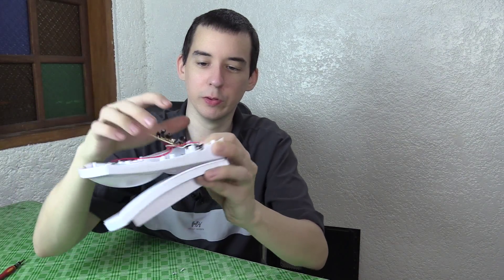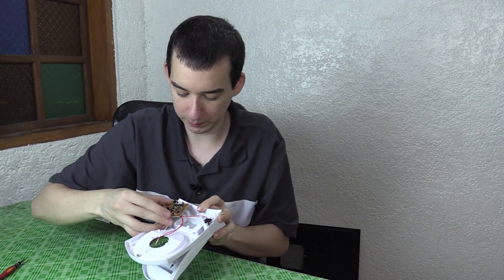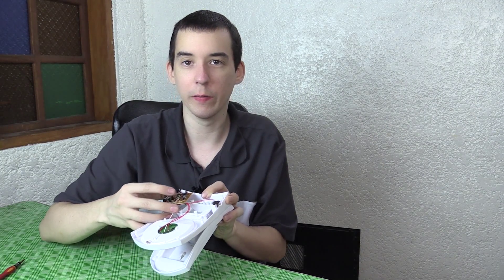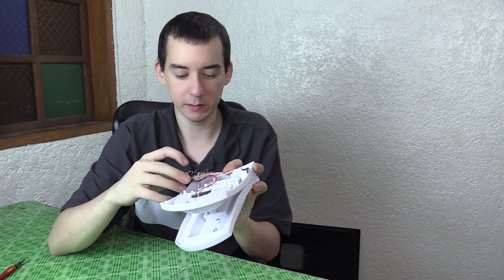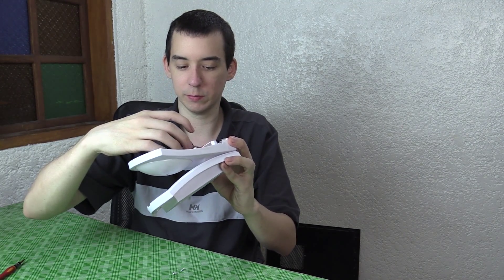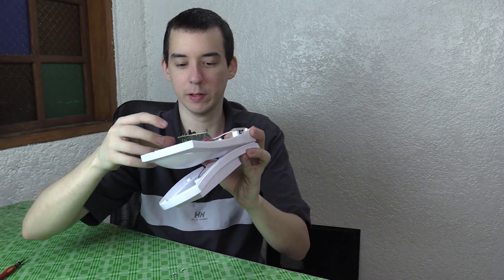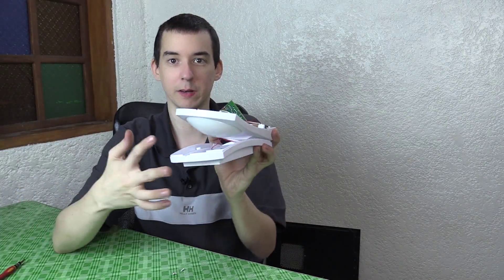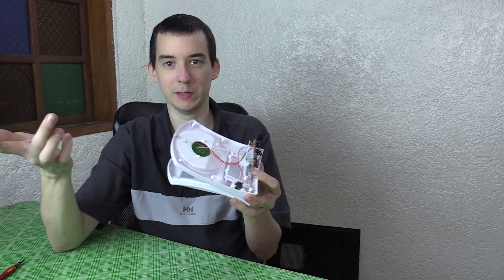I had to look up what the chip was — it's a BISS0001, and when I looked it up it's actually a dedicated PIR controller IC. So there's really not much else on there: just that one IC, some resistors, caps, a switch, and the PIR sensor itself. This is great because I can take this whole sensor board and use it in different projects, and it only costs 150 peso, which is a lot cheaper than buying it from elsewhere.